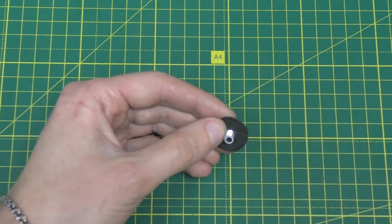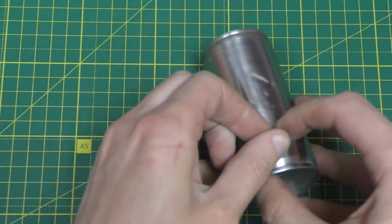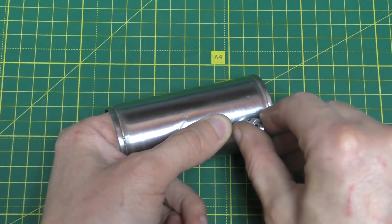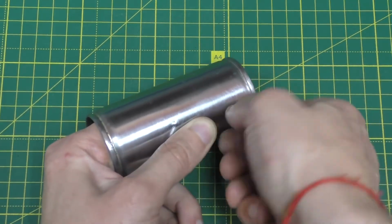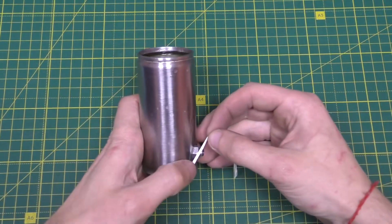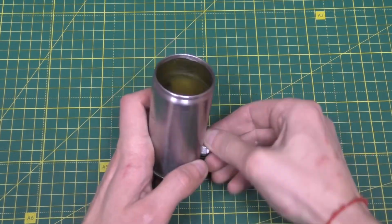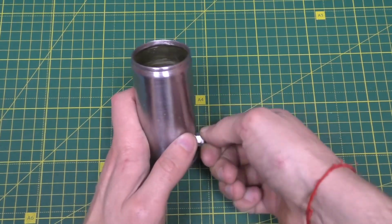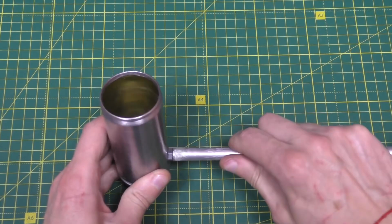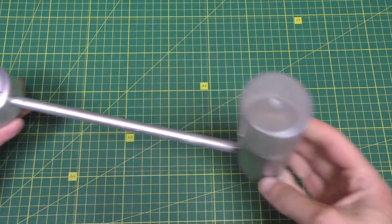We put a rubber gasket on the bolt, then insert it into the balloon and tighten it with a nut. To prevent anything from leaking, you need to wind a foam tape on the bolt, and after that, attach a structure made of aluminum cans to it. We close the lid, and for now, we put it aside.